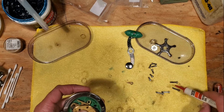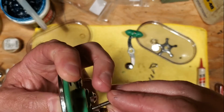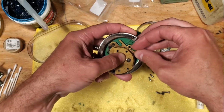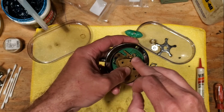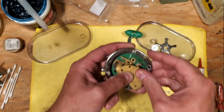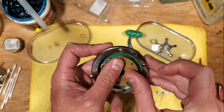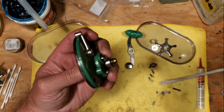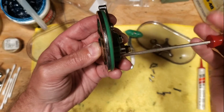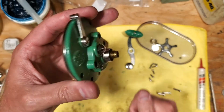So we're going to apply our beads of oil on all these 4 screws here. Note that the fully threaded ones go in the bottom 2 holes of the bridge assembly. And we're going to start this one here so that we can place our dog in place, like so. And then we're ready to put our dog spring in position. And it should look something like that. Okay. And you can start rolling back. Once you hear that click, that's usually a good sign. Take your screwdriver and thread a little bit more on that lower screw. You don't have to tighten it up completely, but just enough, and then you can start turning your handle on the bridge sleeve there, and it sounds good.